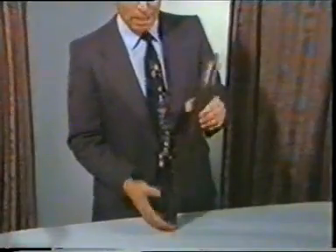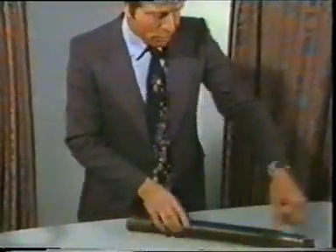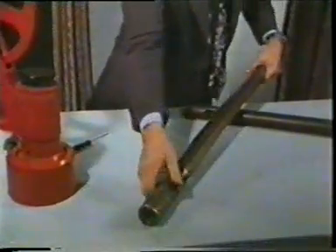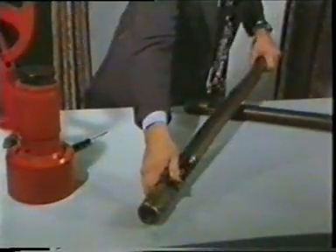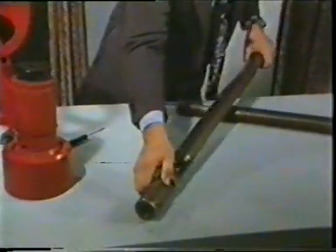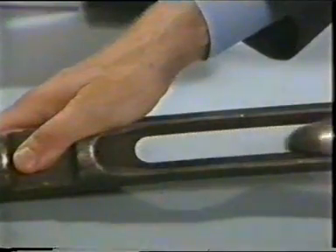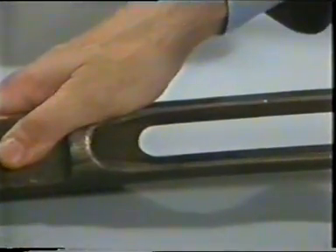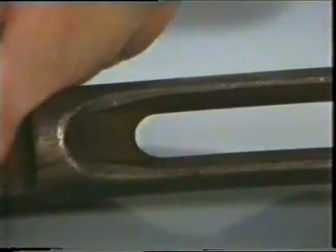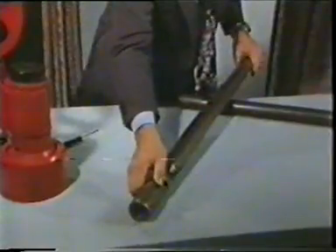The stem can be raised and lowered again to deliver a hammer blow, although the blow itself is actually delivered by the bottom end of the tool string, known as a set of mechanical jars — rather like an elongated chain link, somewhat squashed on the outside. What the operator does is raise the wire, open the set of mechanical jars, and then at precisely the right moment lets the wire go to deliver the hammer blow. The skill lies in knowing precisely when to let that wire go.